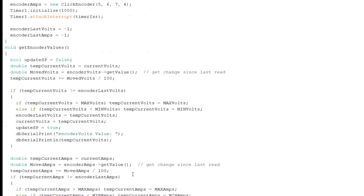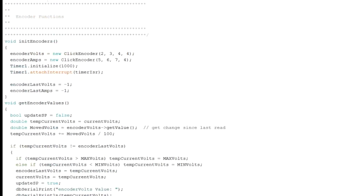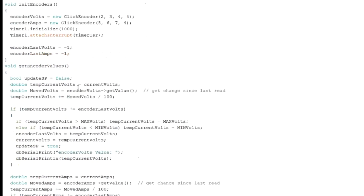Before initializing callbacks, I show the splash screen for 4 seconds, then initialize volts and amps to zero on power-up. The loop function is much simpler: every iteration I call nextLoop to scan for incoming messages from the Nextion display on the serial port, and call getEncoderValues to check if any encoder button presses or rotations have occurred since the last pass. The encoder ISR captures events every millisecond in the background; here we just check if anything changed.